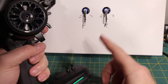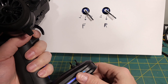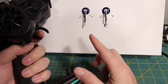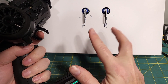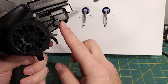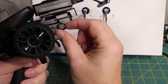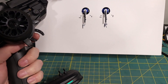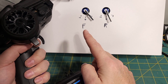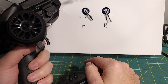Here's the radio and my fake speed control. You can see full throttle front and rear, full reverse front and rear — analogous to having the speed controls hooked up to a Y into the same channel. I've got the overdrive on this pot. Right now at 100% it's equal front and back. Turn it down to 50% and we get full throttle on the front motor but only half throttle on the rear — that's 50% overdrive.